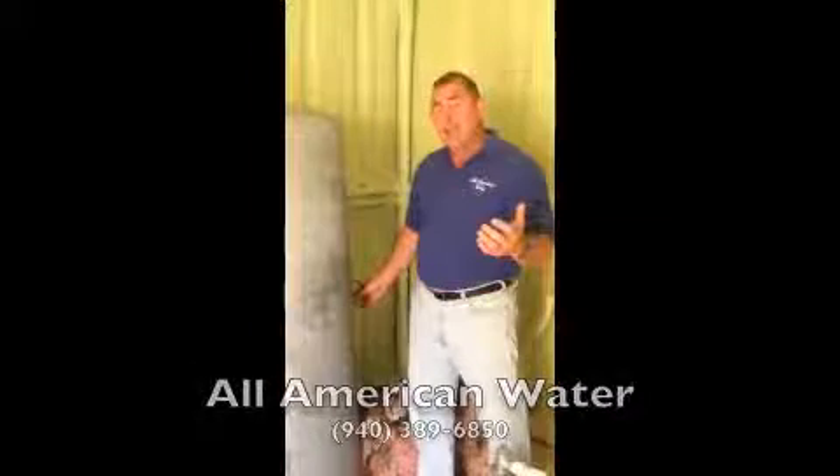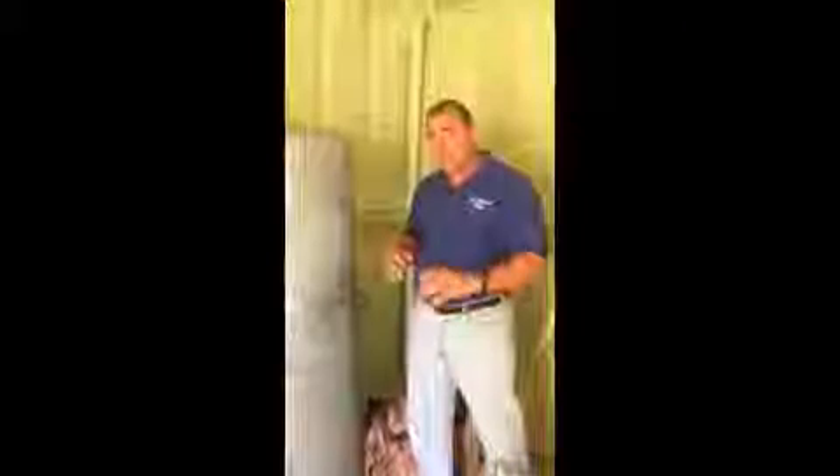You can call your water well guys — you can call us at All American Water — and we'll come out and replace your air volume control valve. If you're out in your well house and you hear your pump clicking on and off repeatedly, and you're experiencing pressure then no pressure in the house while taking a shower, your tank may be waterlogged. When your tank is waterlogged, it usually indicates a bad check valve, a bad bleeder valve, or a bad snifter valve — those will be covered in other classes. This will cause your pump to short cycle and shorten the life of your pump.